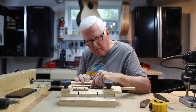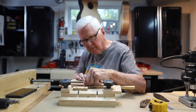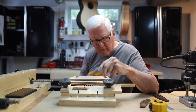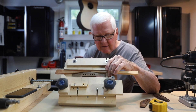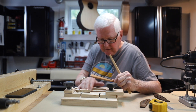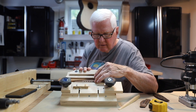I have a center line on the saddle and I line it up with the center line here, so I know that I'm centered — this mark and this mark are going to give me my 70 millimeters on an angle. I have another stop piece here, and this is slotted. I just simply slide that in and tighten it down so that for a quick adjustment, I know that when I take the bridge and push it in there and have it tight against that side, I know that it is centered. It can't go anywhere — it's perfect.